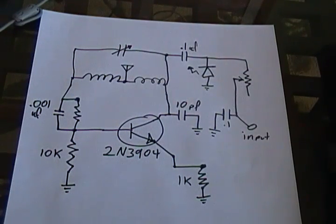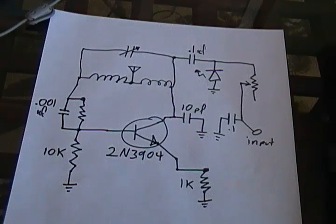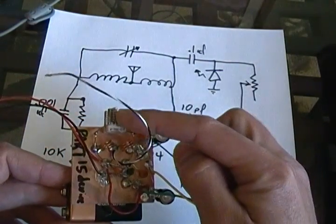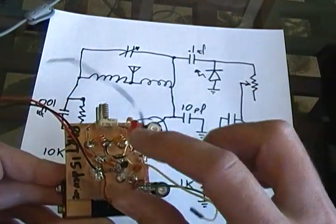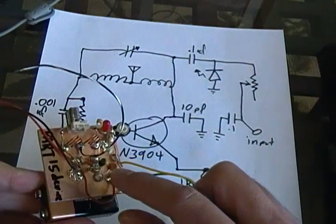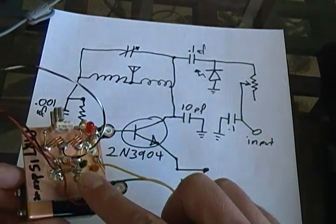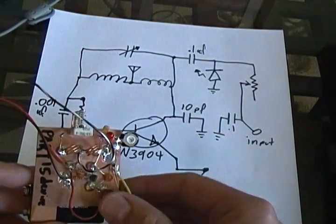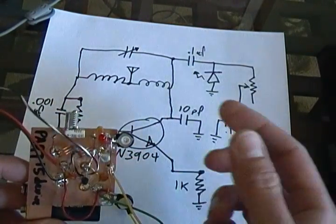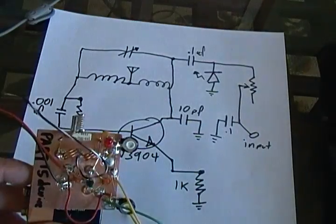So all very simple stuff, very unstable circuit. I had to tinker with it for a few minutes to have it operate on the same frequency as that station, so you have your coarse tuning with this variable capacitor. We have our two coils that basically make this a Hartley circuit — I believe it's Hartley. A single NPN transistor right here, 2N3904. Emitter resistor, some bypassing, voltage divider to have our feedback back into the base. And then all we do — ignore this potentiometer here, that's for future use, happens to be a 50K but that's just what I grabbed — we have to give a little bit of resistance in there so we're not pulling the LED too hard. And that's really it.